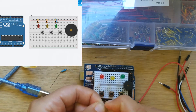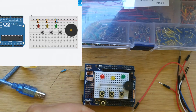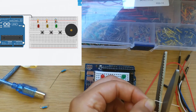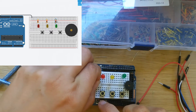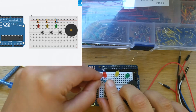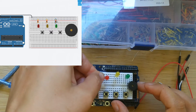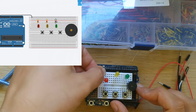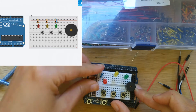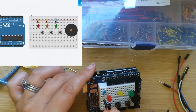For red, I would want the resistor to be really short because it only needs to span those three holes. I'm going to fold my little resistor, cut these legs off, and since it's such a short distance I'm spanning, it's going to be like a little bit of a heart right there. We can go at a diagonal — I think that might work even better. So I'm going to go to the top of that LED and go all the way. That little resistor is going from the short leg of the LED — that's the left-hand leg — and it's going into the row we're going to connect to ground.